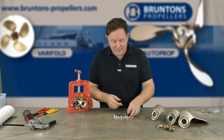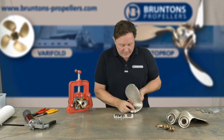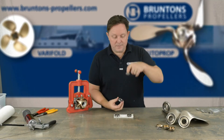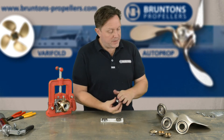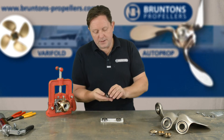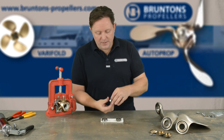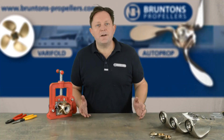The next part is to put on the taper roller bearing. Take the bottom part of the roller bearing — this is the narrowest diameter — and gently push-fit it inside the blade. This orientation is very important: the smallest diameter goes towards the boss and the largest diameter towards the blade tip, so that when you put a nut on, it holds everything together. If fitted backwards with the larger diameter at the bottom, the bearing won't hold the blade and it will come off. This is a possible cause of failure, so please be very careful to fit the taper roller bearing correctly.